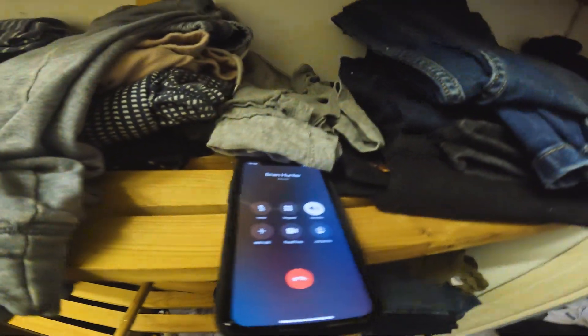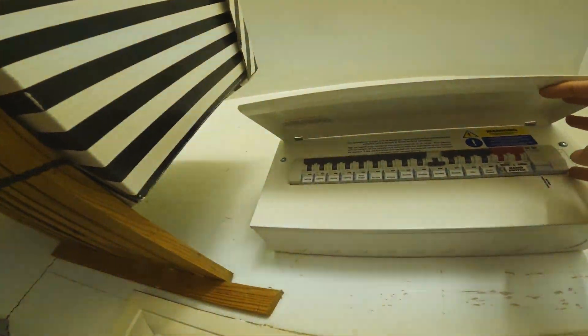Right, we've had enough fun playing with dogs. So we're into the job then. There are multiple ovens, hobs, double ovens and single ovens going in. What we're going to do is test all the different circuits and see what we've got to play with. We need to make sure the lighting's on the same circuit, sockets on the same circuit, or if it's split even better. There are two feeds already down there so we can move them where we need to. We've got a plug-in tester in — let's turn off some circuits.